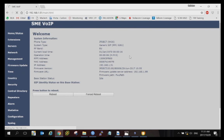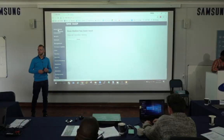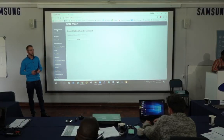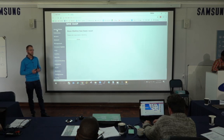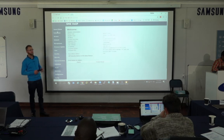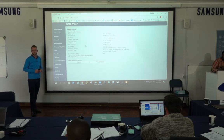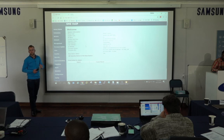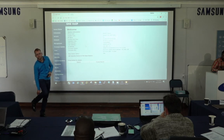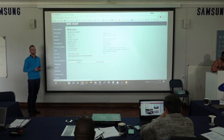Yeah, so the difference between a normal reboot and a forced reboot is if you click on reboot and there are active calls on here, the base will wait for all active calls to be completed, and only then it reboots. It will still allow new calls. Force reboot, I don't care what you do, I'm rebooting. That's what force reboot is. It does that also when you do your firmware upgrade. It will do the software and wait for all active calls, and then it will reboot.